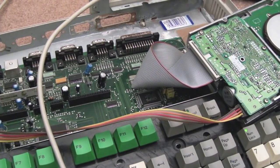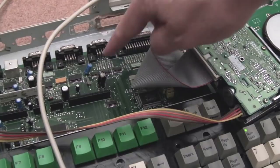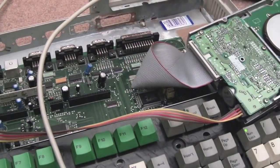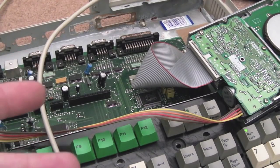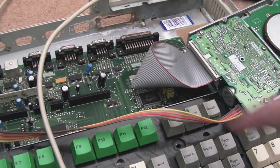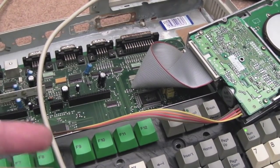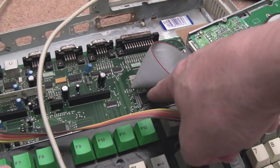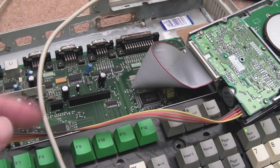Should I just go for it and swap this chip I see here? I do have one - I don't know whether it works, it should, it was sold as a working replacement. Scoping things - I don't think scoping anything's going to help at this stage because I don't think it's about corrosion damage now. The remaining issue we've got is corrosion to clean up here and a chip there to reflow. I don't think it's going to be a damaged trace or a short like we had on the RAM where three address bits were shorting.